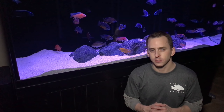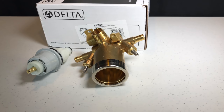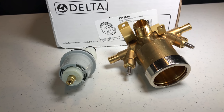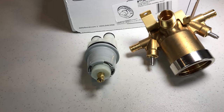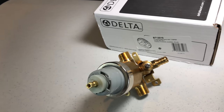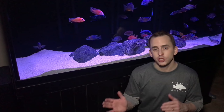The first major piece of equipment in this system is a rough-in shower valve. This allows me to set one stable temperature for all the water that runs through the system. There are many variations of this valve by Delta and other manufacturers, but I went with this model because it has connections for PEX tubing. These valves take a cartridge which does the actual balancing of the pressure and temperature. You can buy the cartridge separately, but I just bought a trim kit which was less expensive. If you take a shower and you set the temperature and it stays there the whole time, it's one of these valves that's doing the work.